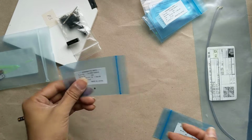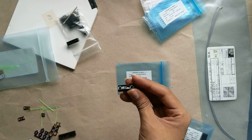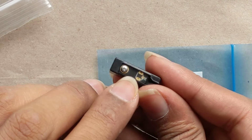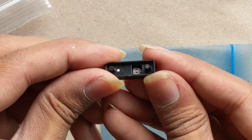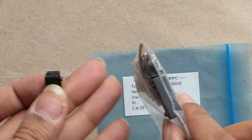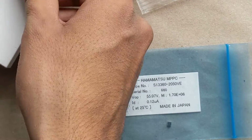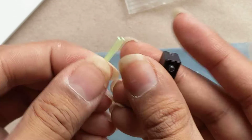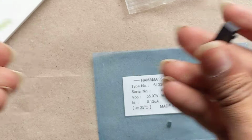So these get mounted onto these assemblies that we have. So here is an example assembly. Let me zoom. This is an injection molded part with a custom circuit board with a connector for a cable as well as a screw for mounting. And this is assembled with these M1.6 screws into this plastic unit, and it is made so that when these two fiber optics land on this side, they are aligned with where the SiPM rests.